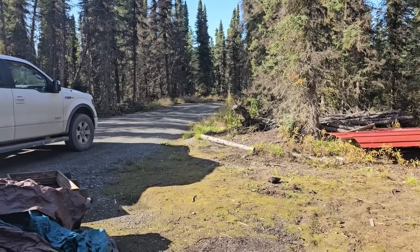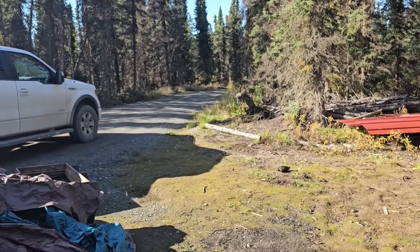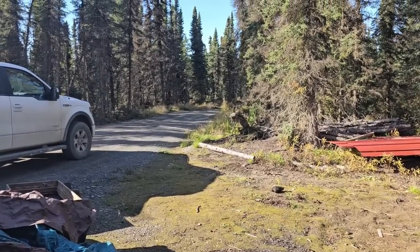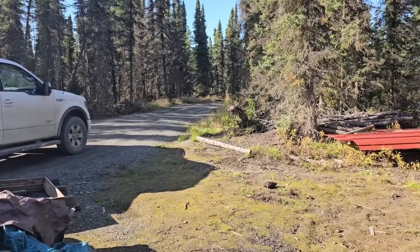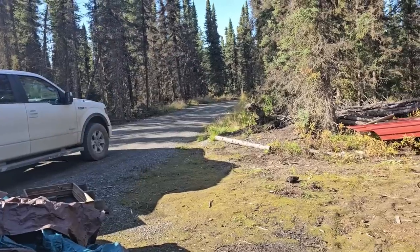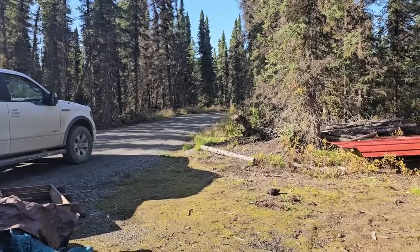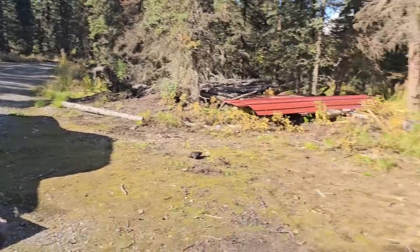But if you look in the driveway, you can see right down the middle here where everything is really as level as it always was. And then on both sides of the middle, you can see where I drive all the time. And that's what I'm after this year, is I want to add some more gravel to that to get everything all leveled out, maybe slope it off this way here, so that when it melts, it'll all go off to one side or the other. But not slope it too much, because then it's an issue of sliding off. But it'll be easier to get the snowblower in here and clean everything off if I've got all the gravel in here.